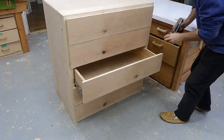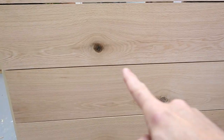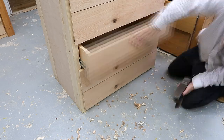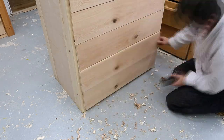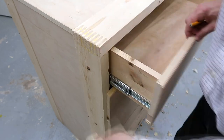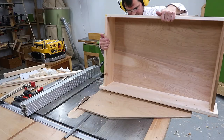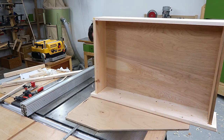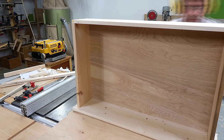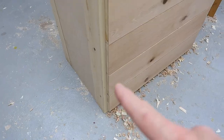Just this one here nearly touches. That's almost the right size, maybe a bit bigger — big enough for a sock to fit in there. After that, tweaking the rest of the gaps. Next I gotta trim the drawers so the sides line up straight. I use my usual method of first making a backwards scoring cut before cutting it all the way off — that way I get no tearout. Those line up nicely now.